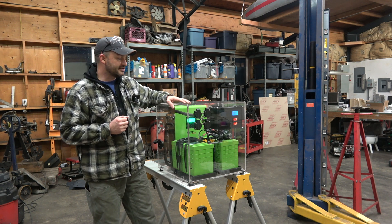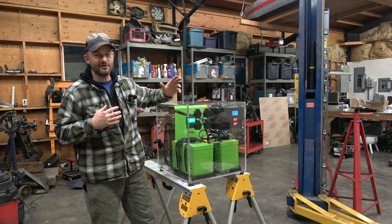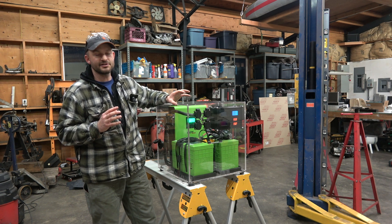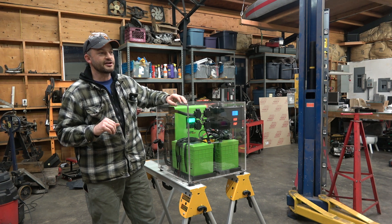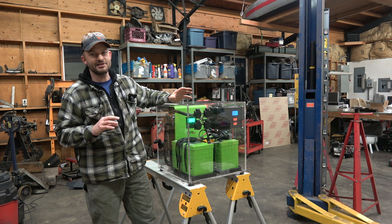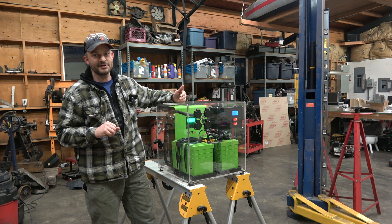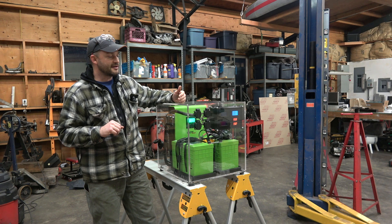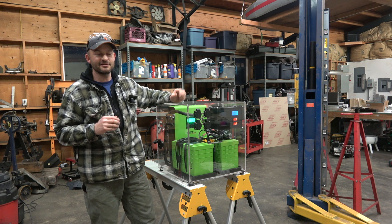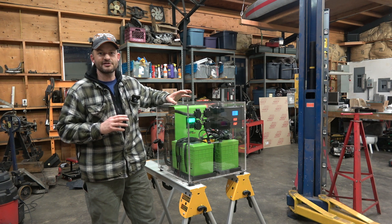I need something like this for work. I fly drones professionally and I'm out in the woods where there's no power behind lock gates and everything else. When I first started doing this years ago I was using the inverter in my truck, but I started killing my truck batteries. Automotive batteries are not designed to be deep-cycled, so last year I switched to using a Honda EU1000i generator. That worked fine except I really didn't like having an engine running all the time, plus the complications with fire season, so I was looking for a solution to charge all my drone batteries during the day.